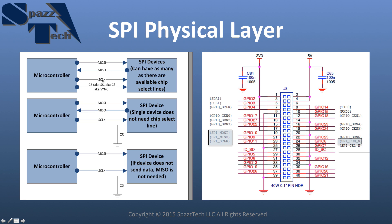The fourth line is called many different things depending on which data sheet or device you're looking at. The Raspberry Pi calls this a chip-enable line. The device we're using today actually calls it a sync line. The BCM2835 library calls it a chip-select line. I've also seen it called a slave-select line. What this does is it's a high or low signal that tells the device that it's the one being talked to. We can have multiple devices connected to the same Master Out Slave In, Master In Slave Out, and clock lines — and then use this fourth line per device to select which is active. On the Raspberry Pi, we have two of those available to us.